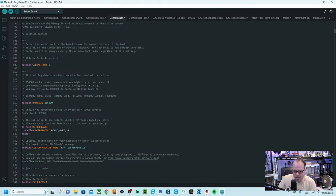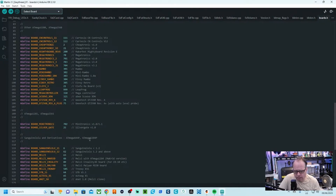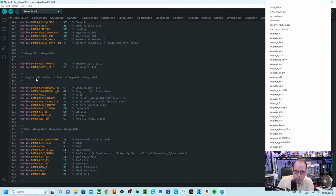We are going into configuration.h to look inside the brains of this 3D printer. The board I used is the ANET 10 / EZ3X1. Now looking at boards.h — the RAMPS board is listed, and I can see with each board it says which chip it uses. The ATmega1284P is the one I need. We have many Melzi boards listed, and the one I need is board number 69.